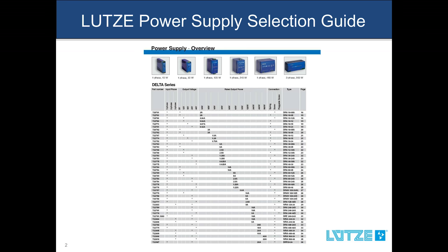There are three main ways to select the desired unit. First, you determine the appropriate input phase — we have one, two, or three phase options. Then you start the selection with the information at hand, which usually is at least two of three key pieces of information: wattage, voltage, or amps for your power supply requirements.